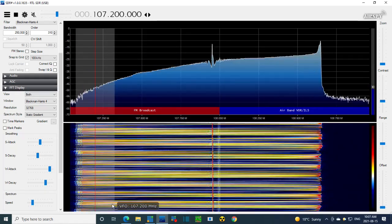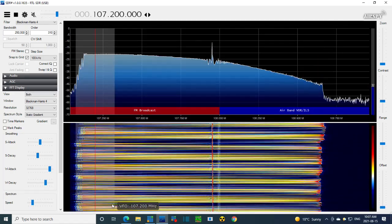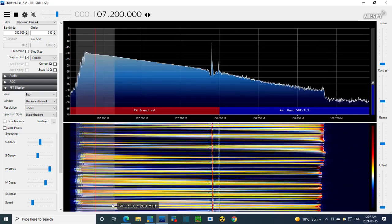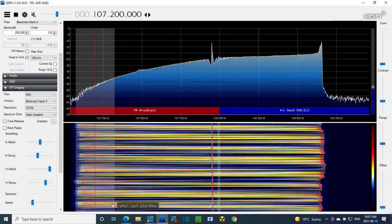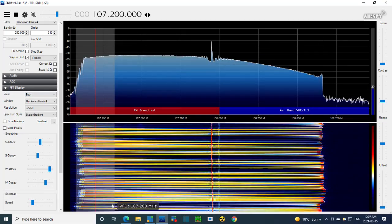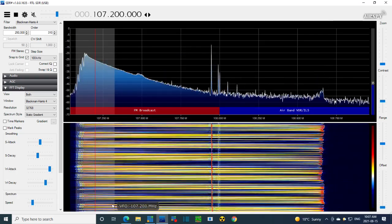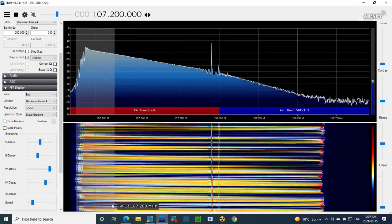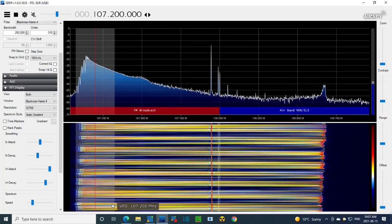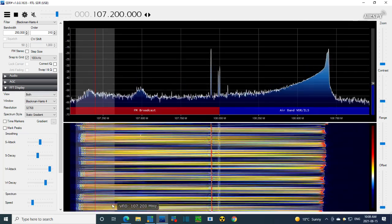What can we do with this? Well, this would provide the S curve and the IF response curve at 108 megahertz, where I have it set now. My other signal generator, the one that's really designed for doing FM work, is fixed at 100 megahertz, but it also produces a sweep width control and all these different things. It's a little better. It's definitely a better instrument for this because things are calibrated more on my stereo FM signal simulator WR52A, as opposed to the Heath TV alignment generator, Model TS4A.